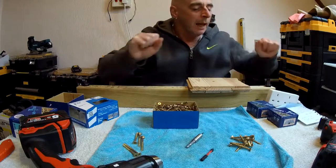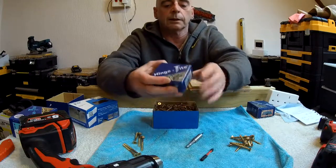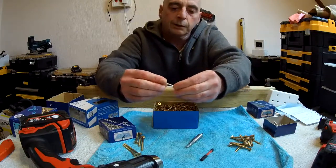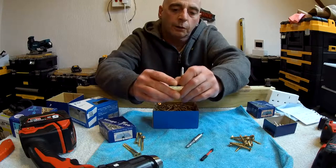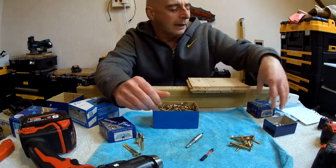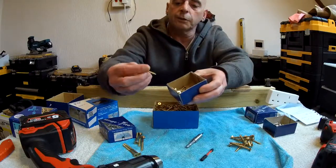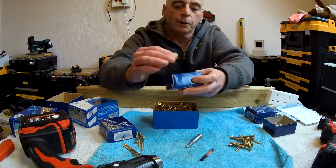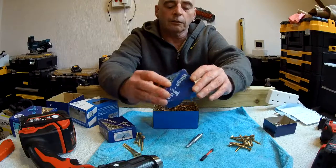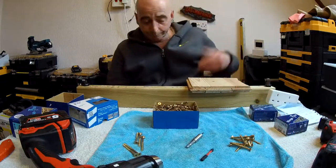Screw Type also do hinge-tight screws — 4.5x40mm. I'll show you these. They come in silver and they also do them in brass. These have a very coarse thread but the same fine starting method. They don't have the double countersink head because they're for hinges, so they wouldn't need it anyway. They also do a 4x30 in brass colour. They're rather small-looking screws but they are brass, and they're PZ2 as well. They're only 50 in a box and they weren't that cheap to be honest.